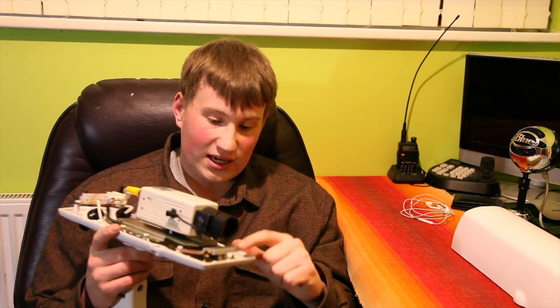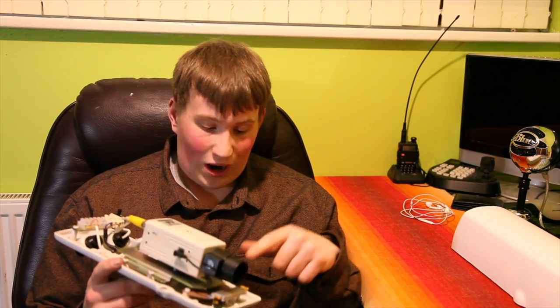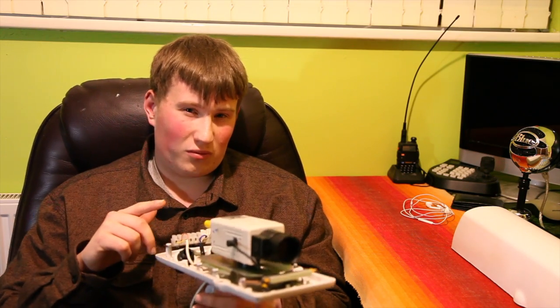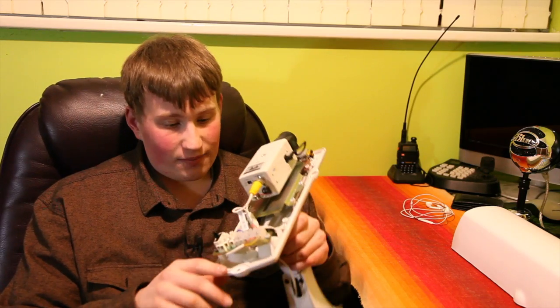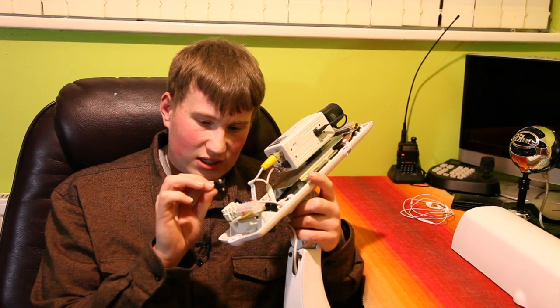It's got a heating element which runs off 12 or 24 volts. If you run the camera with the same 12-volt power supply wired into the heater, it doesn't work — it powers the heater but doesn't power the camera. You have to run a separate 12-volt supply, or use a 24-volt supply which should split the power between the camera and the heater.